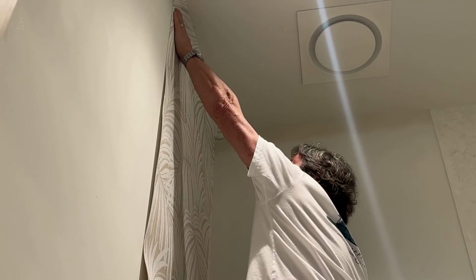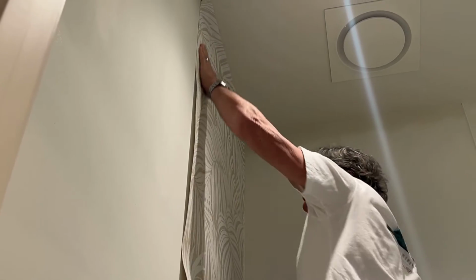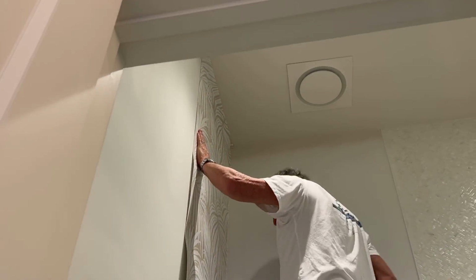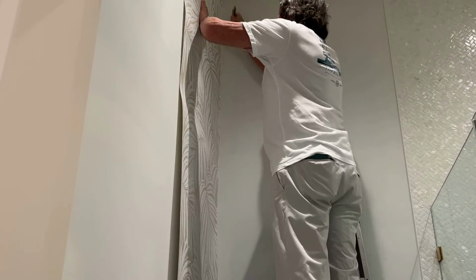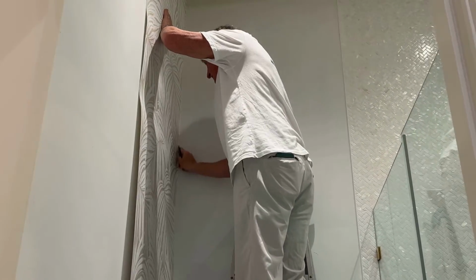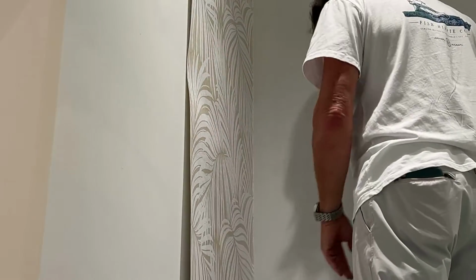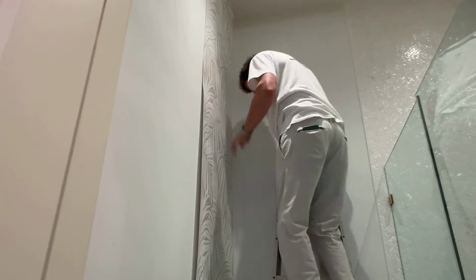And I keep it about 1 to 1.5 inches off the ceiling. You don't want it all over the ceiling because it's going to get glue on it. And here I am overlapping onto this wall about 1/8 of an inch, maybe a 1/16. And it's pretty nice and straight, so I'm happy about that. So before I go any further, I just make sure this is stuck.